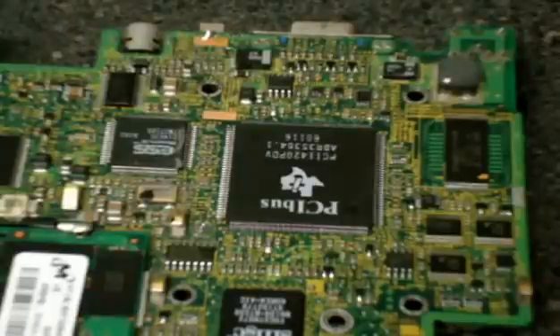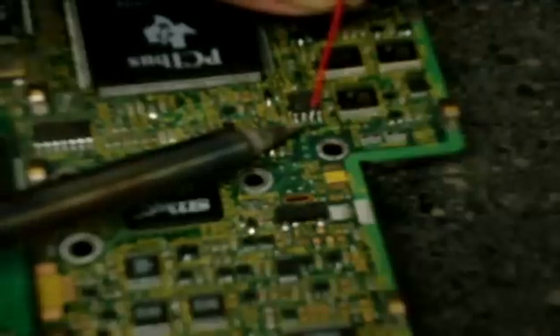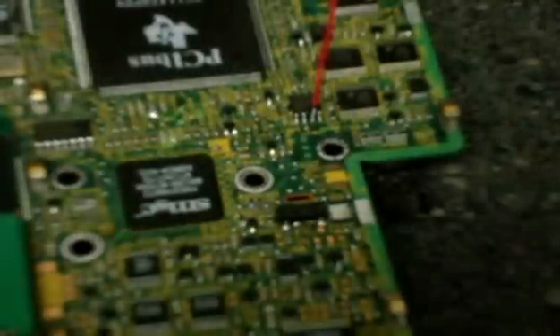And that's going to put us back into basically a technician-class clear for that BIOS, starting off just like it is out of the factory with a clear BIOS. Some people use a paper clip — I'm actually going to solder on just a little wire here. I put a little flux on there, and usually that's good enough.